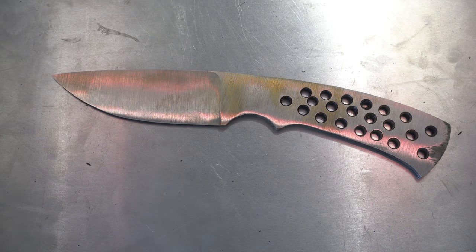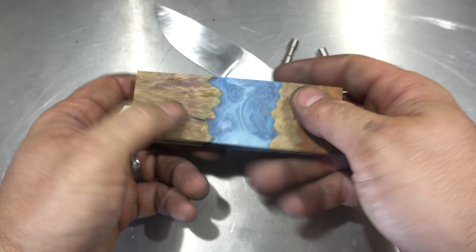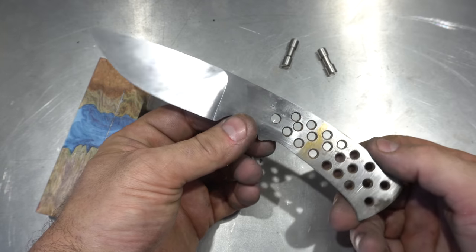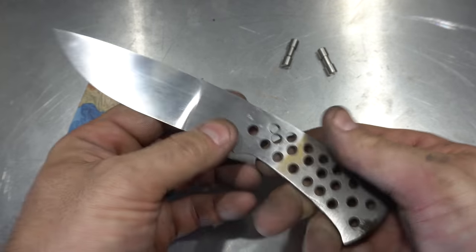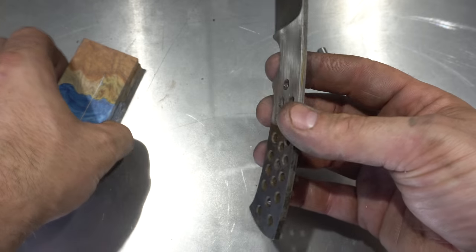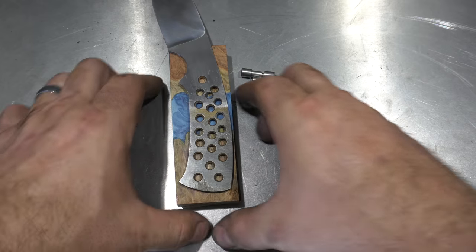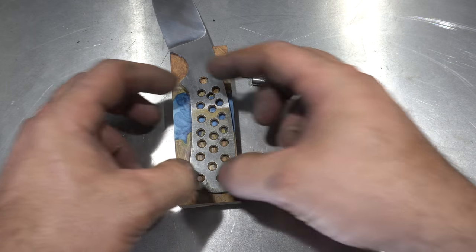It needs some hand sanding and then we'll put a handle on it. I'm ready to start thinking about handle material for this blade. What I've decided on are these hybrid scales — they've got wood on either side with this cool blue resin in the middle. I think they'll look pretty cool. I also want to stone wash this blade, which involves doing an acid etch and then throwing it in the rock tumbler. Because of that I want this whole edge to be tumbled, so I'm going to attach the scales with these Corby screws — Corby bolts, whatever they're called — sand the whole knife and the handle contour so I know the handles will fit exactly the same with the Corbys.